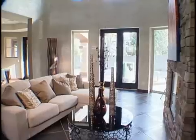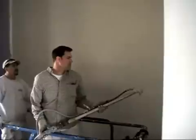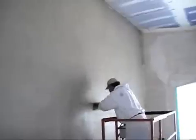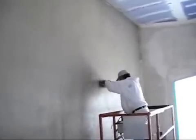What we have on display here are actually two products. On the interior walls, or the interior frame walls, we have PlasterMax IND, which stands for industrial. This is our direct applied over drywall system. It is sprayed on and then troweled smooth. It only goes on an eighth of an inch thick and provides between 8,000 and 10,000 pounds per square inch of compressive strength, and then has double the abrasion resistance of CMU block.